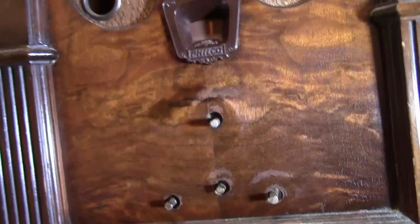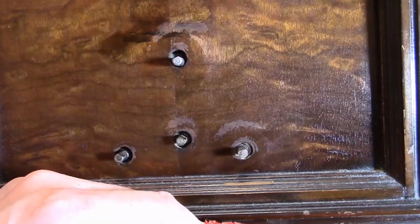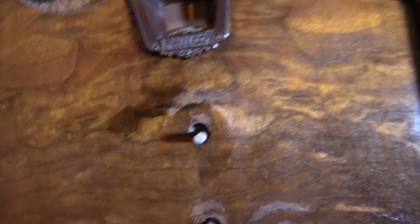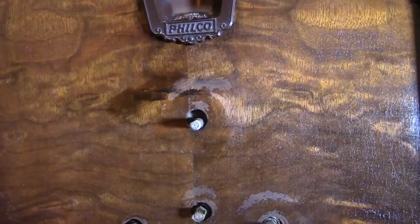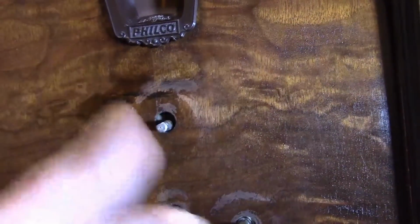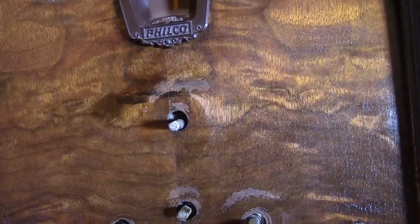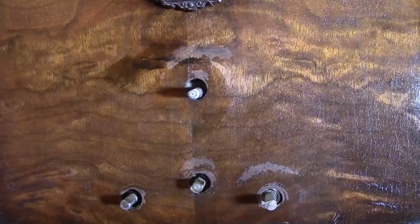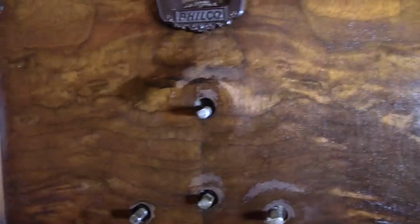Here it is from the front. These three are in pretty fixed positions. They're in holes through the chassis. There's not much you can do about it. But the tuning one, that's the one I replaced the rubber mounts on, and it's off down to the right. So, two issues. The spacers I'm using are, well, maybe I just tightened it down too much. It should be up higher. It should also be over to the left a little bit. So, although I'm not crazy about having to pull this thing back out again, if I really want it to line up, that's what I need to do. So I'll just remember, loosen them and move it that way a little bit.